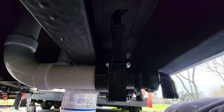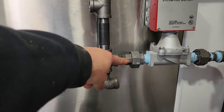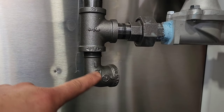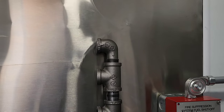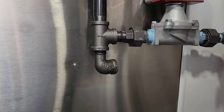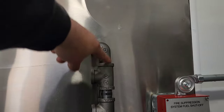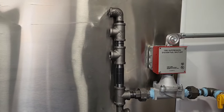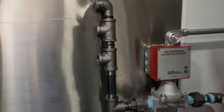For a better visual: I use a three-quarter-inch union, a little nipple, a fixed 90-degree elbow, a T-fitting, and then something called a street 90 — a 90-degree street 90 — two of them, because it's much easier to squeeze in that way. I'm connecting everything together with Blue Monster thread sealant. I'll make it all nice and neat, then put the valves and flex lines on. Home Flex from Home Depot is where I buy the flex lines. Blue Monster is a lifesaver — I prefer it over tape because tape can come off when you reverse-thread it.